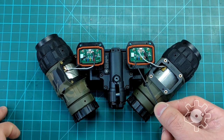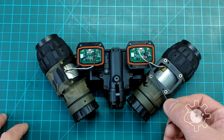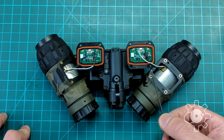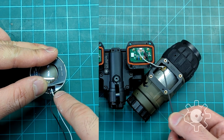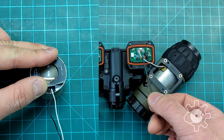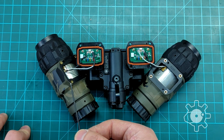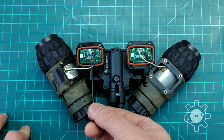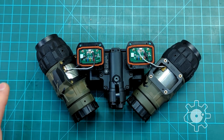To reiterate: we've removed the R2 resistor, which is what you need to do for L3 tubes, and we've added an 80 kilo-ohm resistor at P2 — it's a good idea to heat-shrink that resistor. The black wire represents the wire connected to the left gain terminal in the tube, and the white wire represents the right gain terminal. On the right pod, the left wire is soldered to the resistor at P2 while the right wire goes straight to P3. On the left pod it's reversed — the right wire connects to the resistor at P2 and the left wire goes straight to P3.